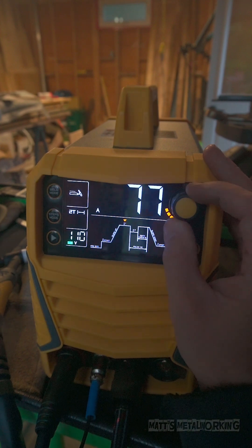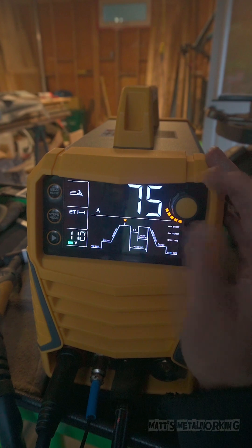I will be doing a test on the mild steel with no filler rod. When using no pulse, this is great for keeping a concentrated heat on whatever you're welding. You will get good penetration, however you do have to worry about burning away excessive amounts of material and you won't have that stacked dime effect. This also allows the bead to become more flush with the surface.